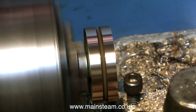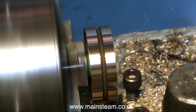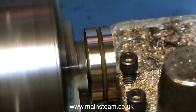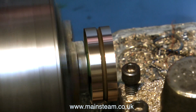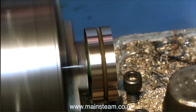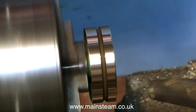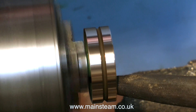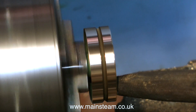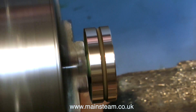I'm having to do this because both the front and rear surfaces of the pulley are badly marked. One of the problems of having to do this is the centre pulley groove, which I don't think was in the middle to start with, is certainly not in the middle now, so we'll have to machine the other side to make it match. It is essential that the finished pulley does not have any sharp edges — it's the first thing someone's hand is going to reach to touch when it's revolving, and a razor-sharp edge that lacerates someone's fingers is not going to impress anyone.